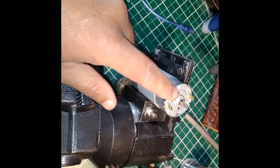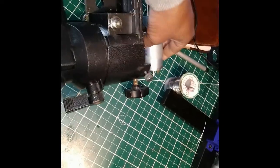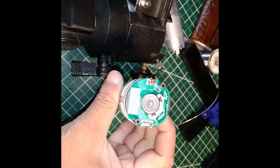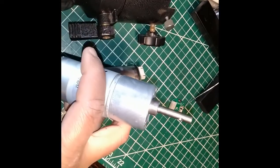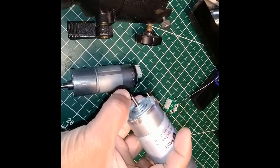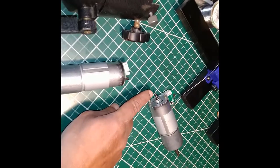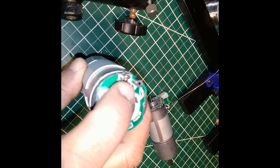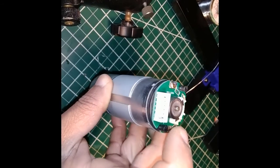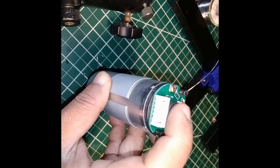These are just plain DC motors, so there's no way to sense shaft position without additional hardware. For that I also bought a pair of encoders — hall effect sensors. I've fitted one encoder onto the second motor. The motor has a small shaft at the rear end; some magnets are attached to a little circular disc on that shaft, and two hall sensors send out electronic pulses as the disc turns. By counting those pulses you can tell how far the motor has turned and in which direction.